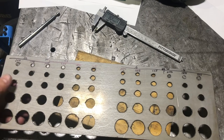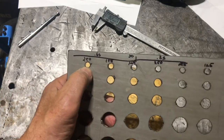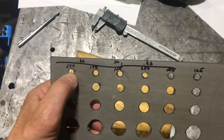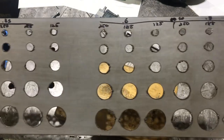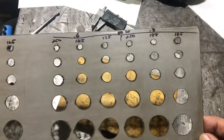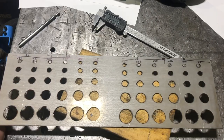I would love to have found something that allowed me to hone in and get better diameter circles, but that's just not the case. So I think you'll see why the Langmuir folks say: if you're doing something down at quarter inch or lower, just pierce it — don't actually cut anything — and that'll give you a spot to put your drill point in and drill it out or punch it out. I wish I had a good answer for how to make perfect holes, but I don't. The next test is the overlap to see if that has any effect.